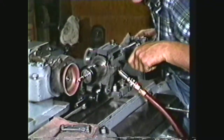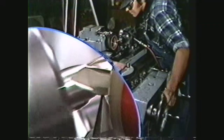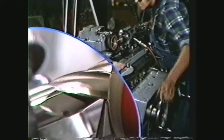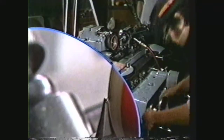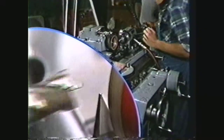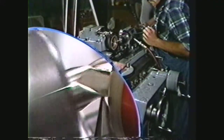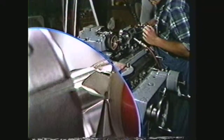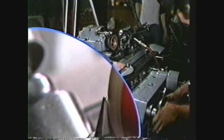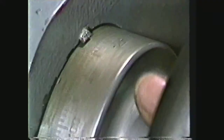Run the end mill over the top of the finger. Rock the fixture head toward the wheel. Run the end mill back and forth over the finger while feeding in. On light contact between the wheel and the outer cutting edge, stop feeding in and set the dial and the feed crank to zero. Make one pass on each flute. If you feed in too far, back off the hand wheel to remove backlash. Then turn the feed crank back in to within two thousandths from the original zero setting. Again, make a light contact with the wheel on each flute. Then re-zero the dial.